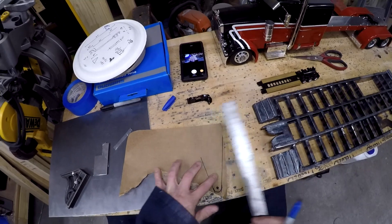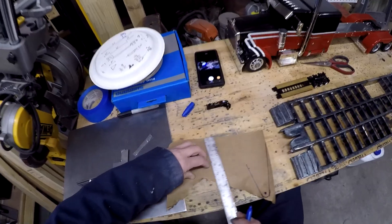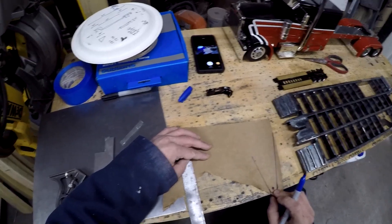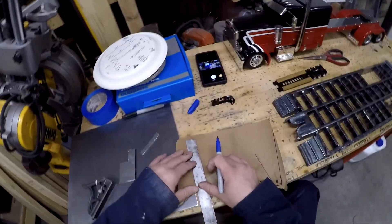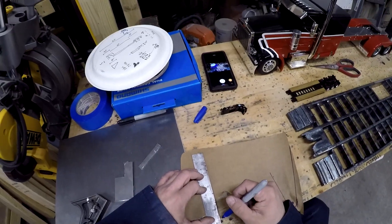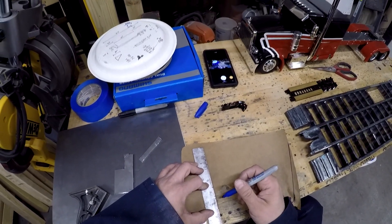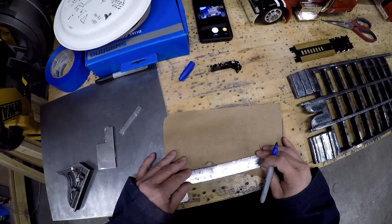My neck needs to be at least three inches from the ground in the down position. When it tilts it'll be three and a half inches. So it's gonna be sitting about three quarters of an inch off the ground roughly. I'll give room for suspension travel, so three quarters of an inch minus three and a half - that's already factored into the trailer's height - so that'd be two and three quarters inches. Let's make that line parallel.